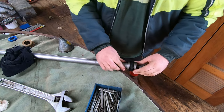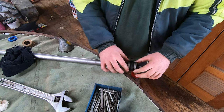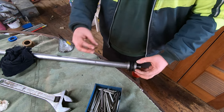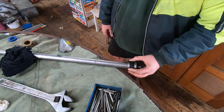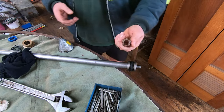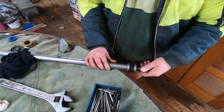So this is the end where the hydraulic pressure is all around this seal and these ends. That's what moves it up and down. Oil gets forced on this side, oil gets forced on this side. So that's what actually seals it. Hopefully this seal will be good and be a nice tight fit. Then it's got a castle nut on the end. It'll just run on.